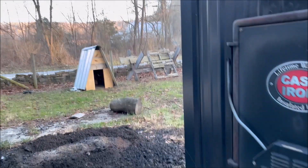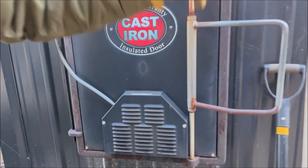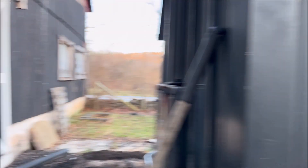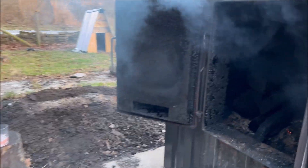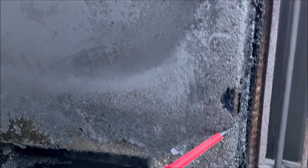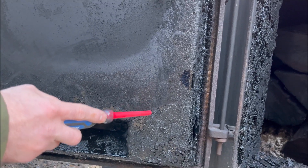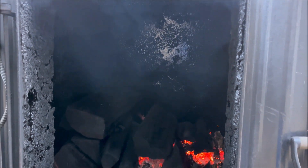This door — show them the vent down here. This door has a solenoid in it that has a damper and it opens and closes. Right now the stove temperature is at 202. It got to acting up — that pump went bad and wasn't circulating water. Let's take a look at the inside of this thing. It's been damped out for a while. It's a big sucker. But here is the only thing with the door — we have one crack on the door here. You should keep your wood back off the face of this thing, at least a foot, and keep the fire in the center of the firebox.